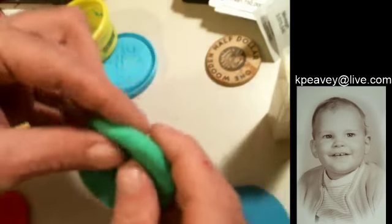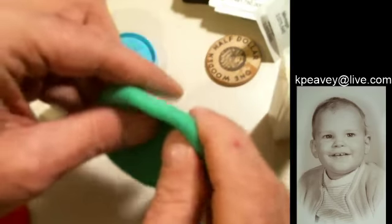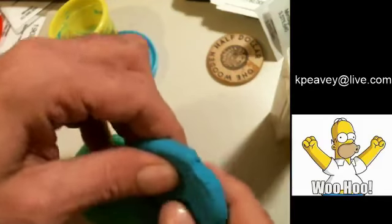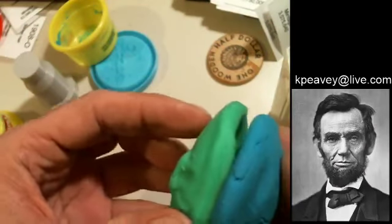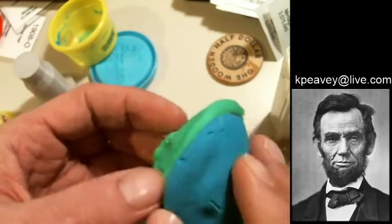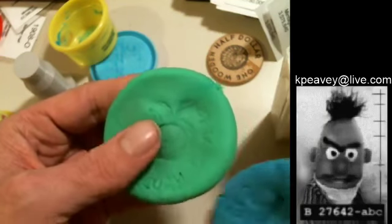In effect, let me really exaggerate it. It's as if you had, you know, depth. I mean, a lot of depth. It's like a mushroom cap. There we go. And the only place they're going to contact is at the fields. Okay, you can't have the details from way in there reaching way in there without destroying the die. It would have to really screw it up.